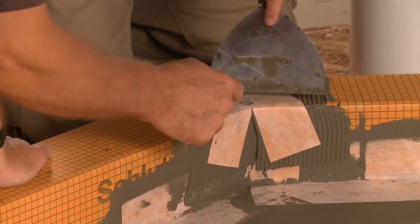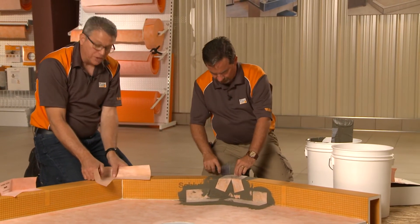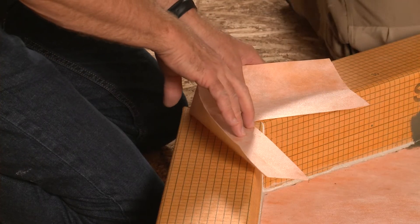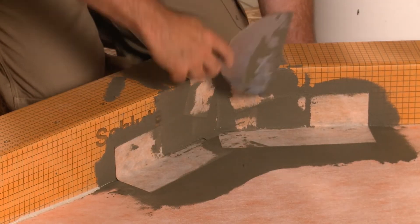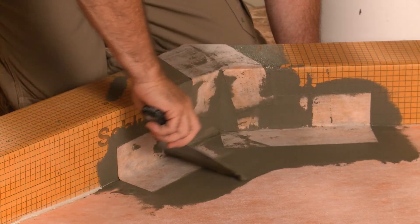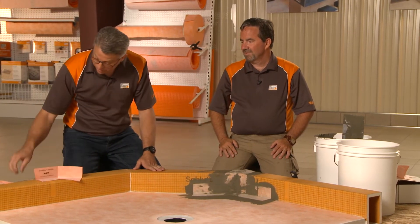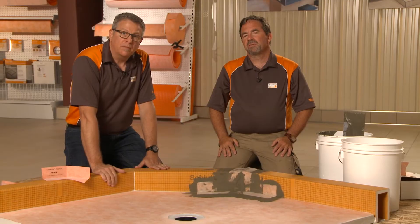Now many may think — wait a minute — we've got a little pinhole down there, but I can tell you, years and years of experience of just doing this with our inside corners, we've really never had a problem with that. When we get the overlap and we get the thinset in there, the thinset cures in this environment and becomes very hard, very dense, and it just does not leak as far as waterproofing goes. So there you have it. Thanks for joining us on this Tips and Tricks video. If you ever encounter an inside corner that's not suitable for any of our others because the angle's not right or you don't have these on the job site, this is a great way to get it accomplished. Don't forget to visit our website, Schluter.com, and subscribe to our YouTube channel for more videos like this.